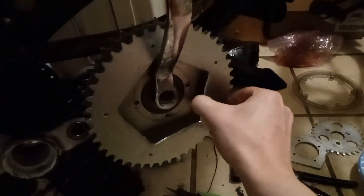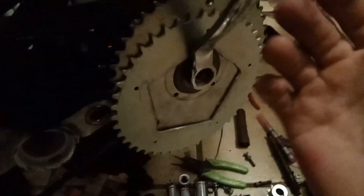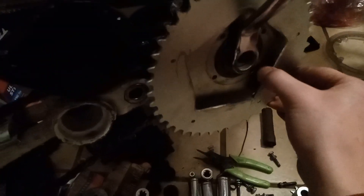This is the other gear, which will be put roughly half an inch away from this to be in line with this. It will be attached to the other gear right here — the solid one — via the holes, and I'm going to drill out some more so that it can be better secured. The reason it's got that space in the middle is to have cutouts for the backspin so that the chain can move — the whole engine can move the whole thing without moving the pedals. This was to go around that problem.